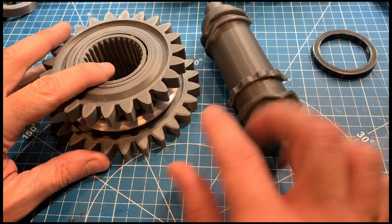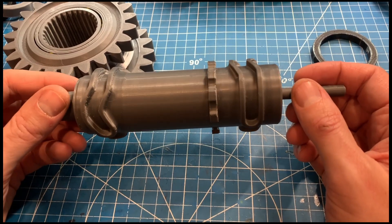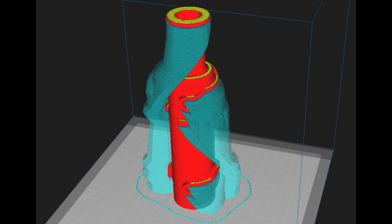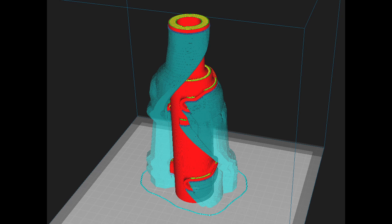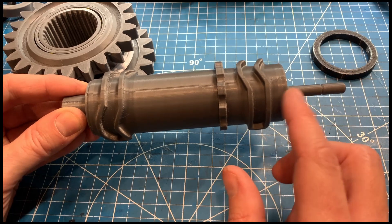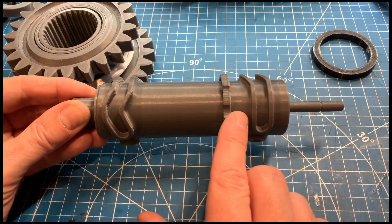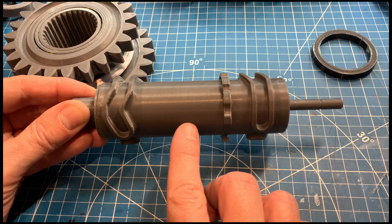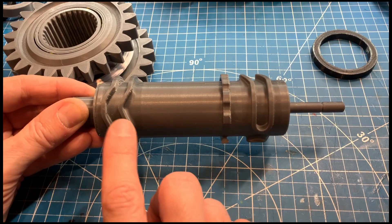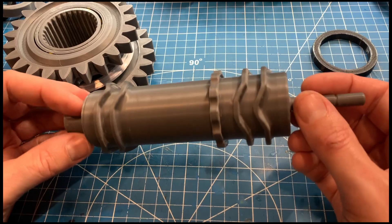Once I have a gear pair with the slider installed in between, I then test print a shift drum. The shift drums are by far the hardest part of the entire gearbox to print. Now that Cura has tree supports, it's made this job a lot easier, but there are still some things to keep in mind. You need to print the shift drums very slow, like 35 to 40 millimeters per second, and at a very low layer height, like 0.1 millimeters. The slow speeds increase quality and give the plastic time to cool for the overhangs between layers, but each of these shift drums takes a little over 30 hours to print. If you don't do this, the pin slots in the barrels can come out rough and misshapen. You'll still need to clean them up by hand, but this is a 10 minute job versus the one to two hours it took on my last gearbox.